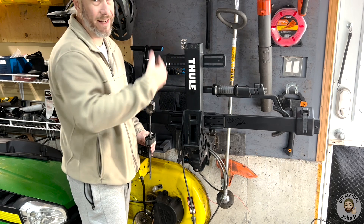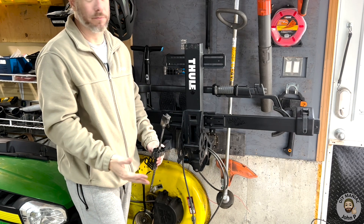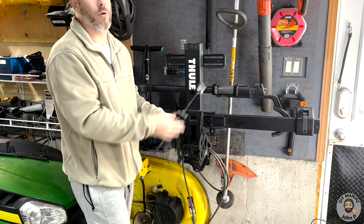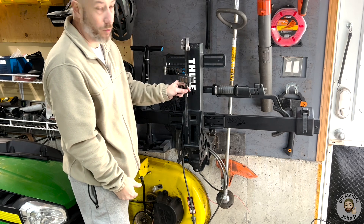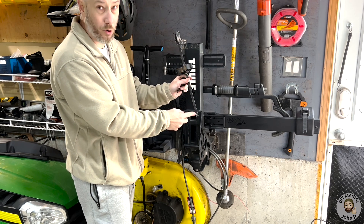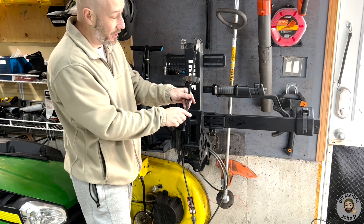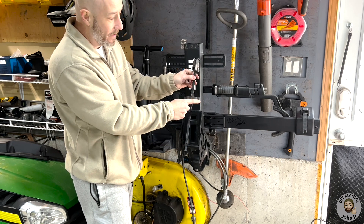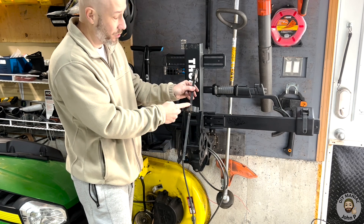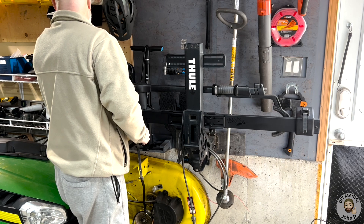Now the big question - probably the most nerve-wracking part - cutting the bike rack and knowing how much to cut off. We want to make it shorter but still keep it functional, so how far do we want to bring that handle down? We also have to look at some of the components. We have this center rod that lifts that locking pin up and down - we can cut that shorter and will need to drill new holes to rivet in the locking pin carrier. Additionally, depending how much we shorten it, we have this center spacer that keeps the rod centered - that has rivets as well, we need to drill those out and reposition it.